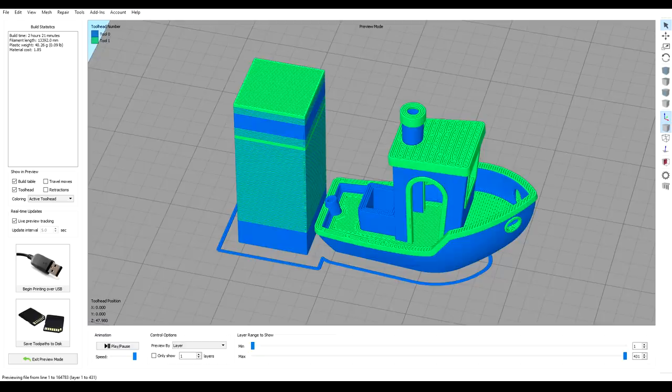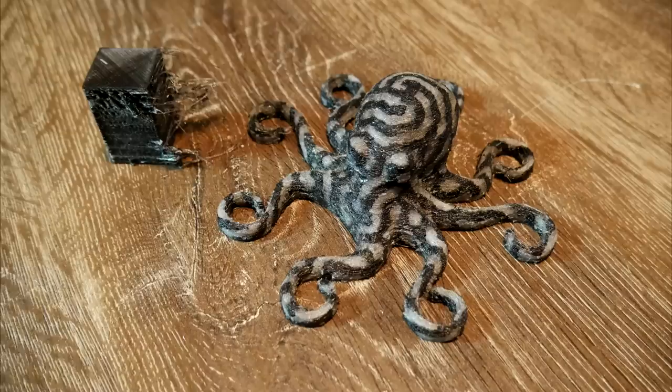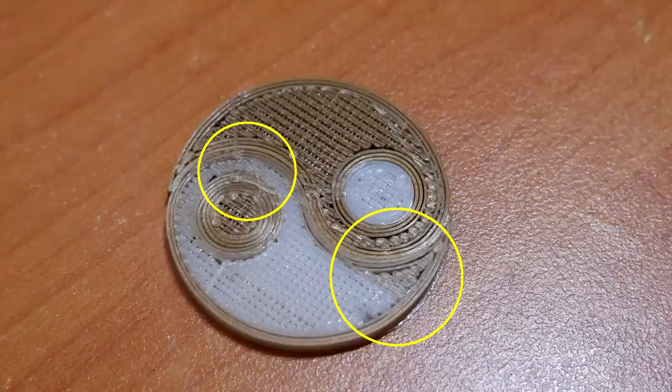This is a prime block. Every time it changes color, it comes over and extrudes a layer so the filament can change, as you can see in this example here, from one to the other. If you get this right, it'll give very clean separation. In this example here, it's not quite big enough block, so it doesn't have enough time, and therefore the color bleeds instead of being a clear separation between the white and the gold.